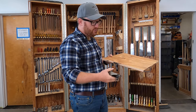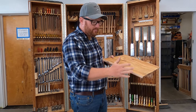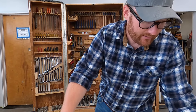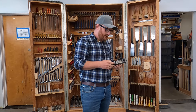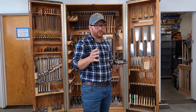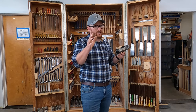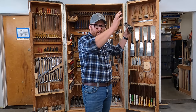You could keep going until you chamfer a really nice profile into it, which would speed things up if you're trying to round over edges with sandpaper. The other thing I really like a block plane for — and I still use it as a carpenter — is when I'm working in the upstairs of someone's house, I'll cut my molding about a sixteenth of an inch longer than I think it needs to be, and then take it up around the stairs trying not to knock all the picture frames off the wall, and test fit it where it needs to be.